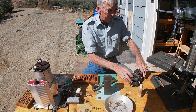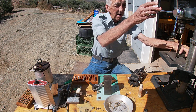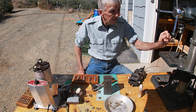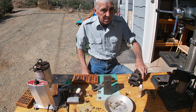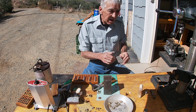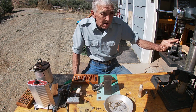And I'd like to back up first. Why don't you take your square and chuck a bit in there and double check your platform here, because before doing this I did, and I was 1 degree off. So I got it straightened out where I could get a perfectly straight hole, and that's important with bullet mold halves. You don't want part of the drill more into the one side because it will never fall out on you.